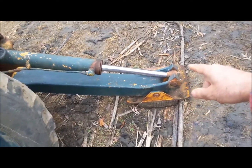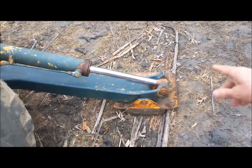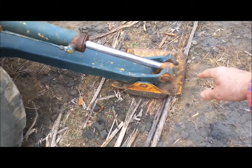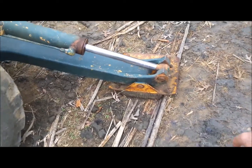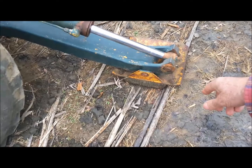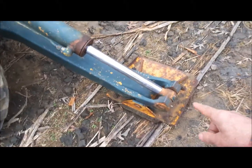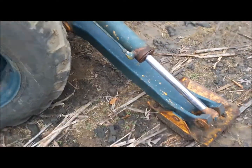Here's another one — the pins that hold these cylinders should not be fitted with such close, tight tolerances, because then they become nearly impossible to remove. This is a classic case where I had to cut on both sides of the pin, and even then I couldn't press those cut pins out. I had to drill through them and then run my torch through them to burn them out. That is shameful engineering. They need at least ten-thousandths clearance, not one or two-thousandths like they normally have. The top pins didn't have problems — that pin came out fine. I replaced the pin down here and even ground it down a few thousandths to give it even more clearance.